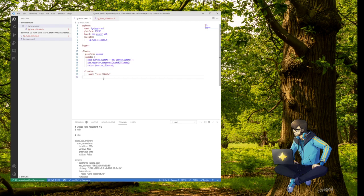Okay, so that means over here I need to define a UART path, and my TX pin is going to be 25 and my RX is going to be 27. I think I need to now go and check what the right definition of the pins are. How do I refer to that? GPIO 23 and GPIO 26. I think, yes.